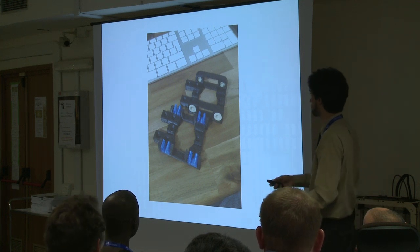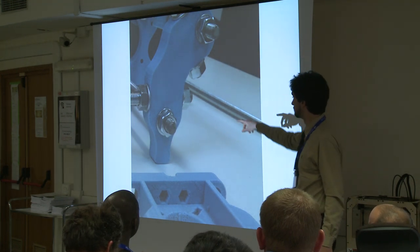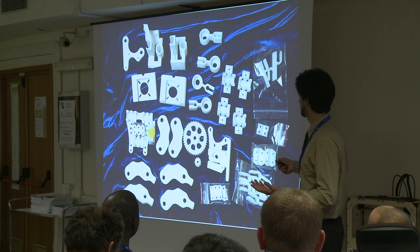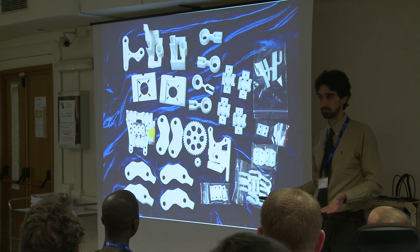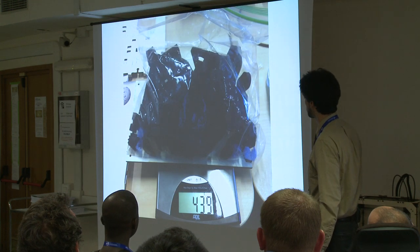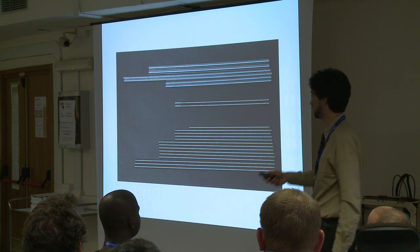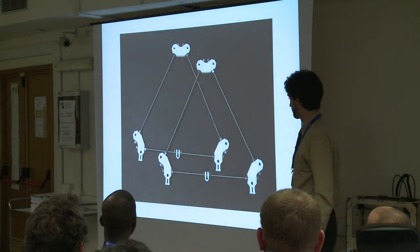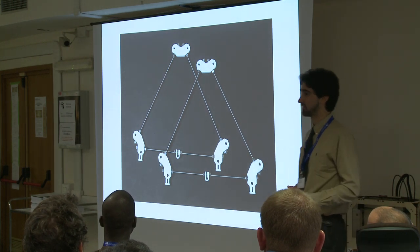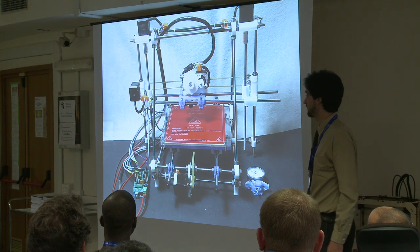So it's a simplification and clean design, and a lot of bolts, of fasteners were removed from the design. So you needed way fewer parts. This is a set of parts to build the Prusa Mendel. If you remember the previous images, this is much less than half a kilogram. And then you need to buy smooth rods and threaded rods and make the two frames. Then you need to add some motors. Then you need to buy belts and pulleys, and you have your Prusa Mendel.